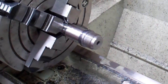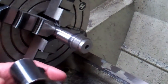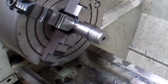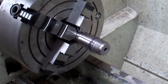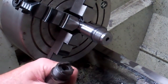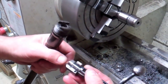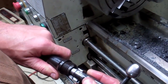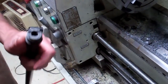Next I'll take a chamber reamer, go ahead and punch this thing out, tighten this up. Before I set the final headspace depth though, I'm going to have to go over to the milling machine and cut a little slot all the way across, just like this. Because your bolt — let me go grab the bolt — the bolt on these particular rifles has two lugs right there, and that's going to go up inside and lock right in here like this.